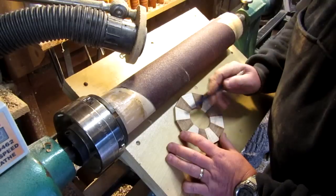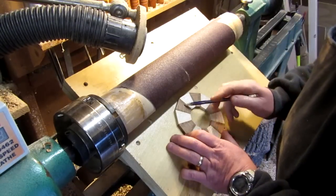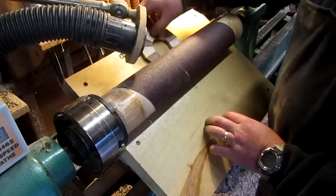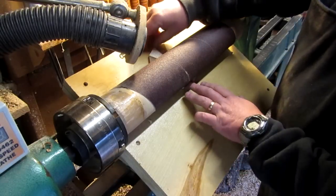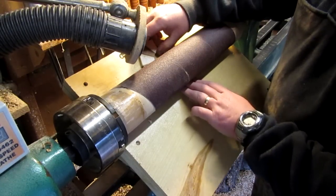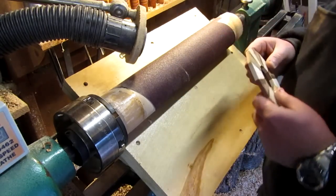But I guess if you've got a lathe that reverses, though, you have to be careful there. But as you come in, as you bring a piece through, if you reach up under there to grab it, you can easily get your hand pulled in. Two-horse motor, it'll probably pull that thing in there pretty good.